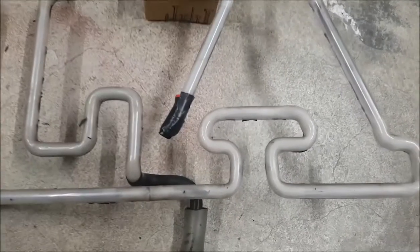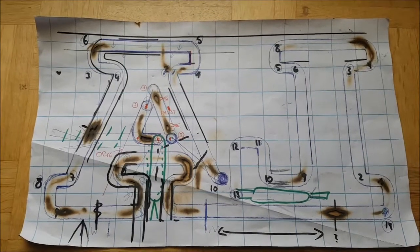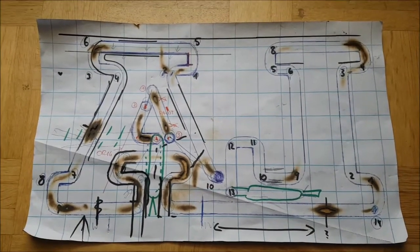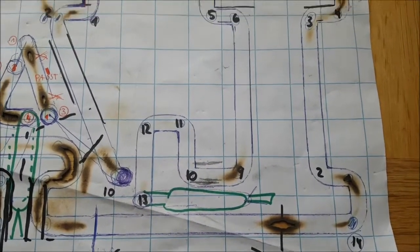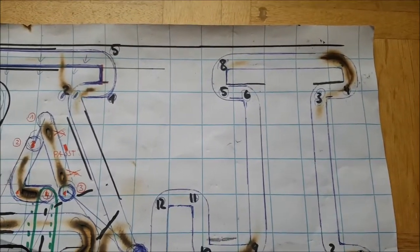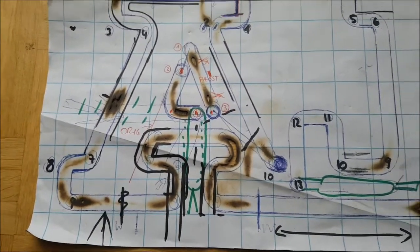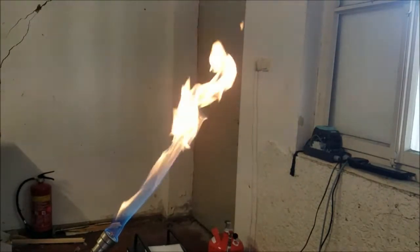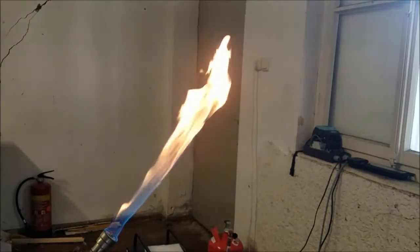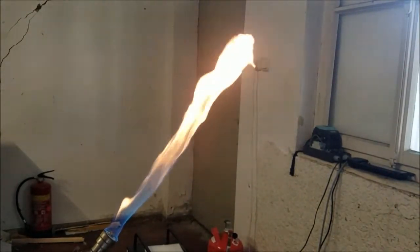I didn't want to use 8 for being a bit too bright, so I used 10, which makes it harder to bend this tight pattern. Next reason, I have lead-free glass, which is the modern version and more difficult to work with than the old days lead glass used in the original. Reason 4, I have this European bench torch that can't really heat such packed series of bends very precisely, because the flame is always a bit bushy and not very sharp.